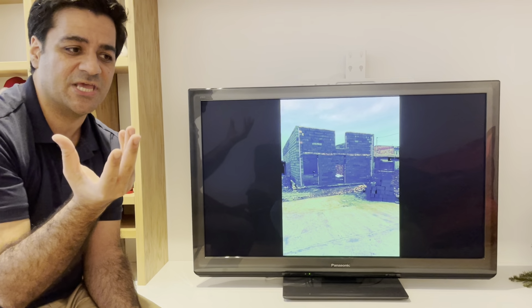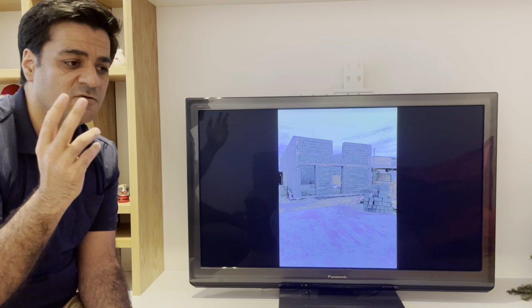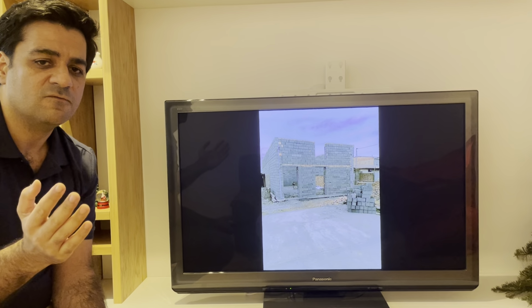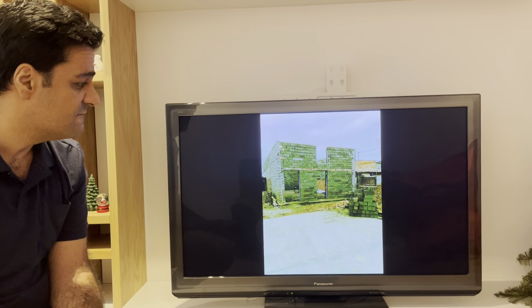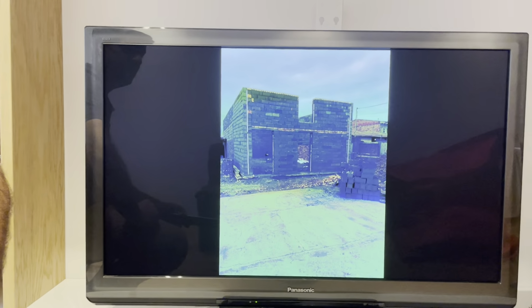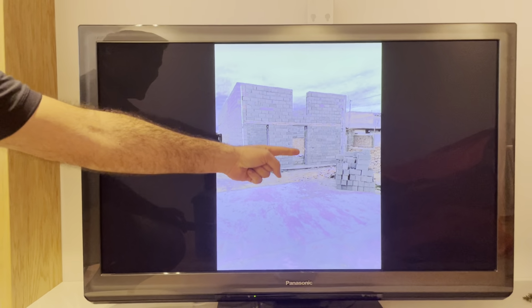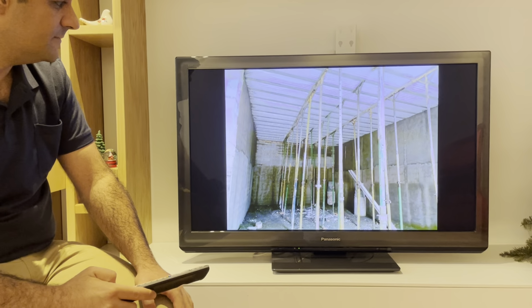With a rectangular shape, you can put 2 rows of shelves, and it helps you to control the environmental factors. For example, if your building is a square shape, you are forced to use 4 rows of shelves, and you cannot control the environmental factors. For example, this is a very simple building with cement block, bridge cement, and it doesn't have insulation like polyester, only one layer, and you cannot control the environmental factors. It is very clear. Okay.